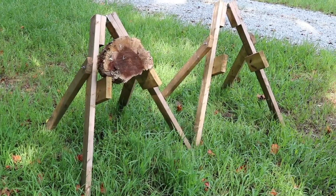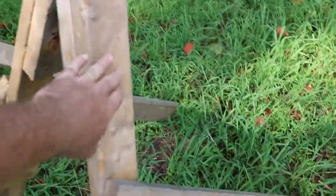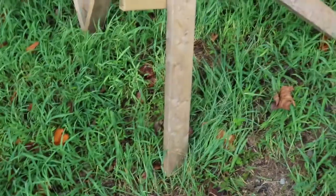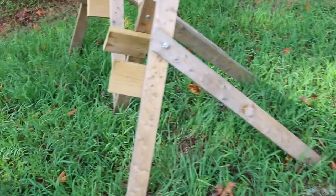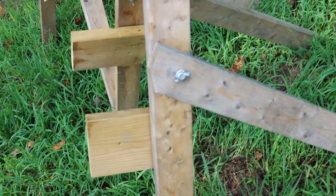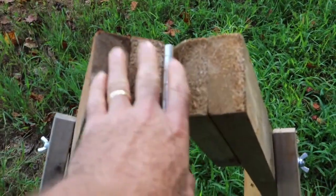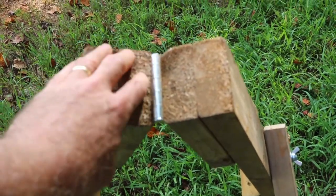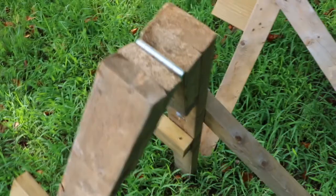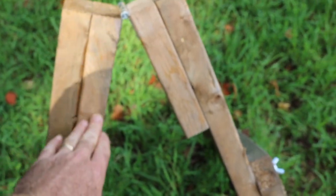The long side right here is 48 inches, and the legs in the back are 42 inches — so they're six inches shorter. They're also bolted about a foot down from the top. It's really important: some people put the hinge in the end grain, but I've done that before and it doesn't work because there's too much pressure on it. As the tomahawks and knives hit, they wiggle too much. It's much more effective if you put the hinge on like so.